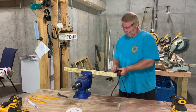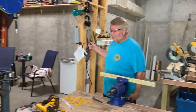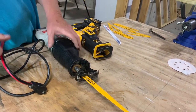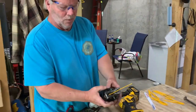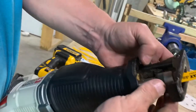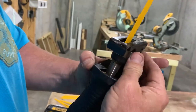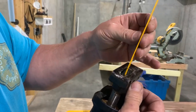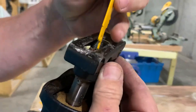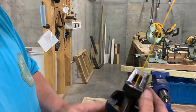Next tool we're going to cover is the reciprocating saw. Like I said, in the industry when you're out there, more than likely somebody's going to call it a Sawzall. Before you change the blades, make sure the power is disconnected, whether it's battery or a cord. This particular one has got a real simple blade change. You can see you've got a little gear right here — all you do is push that button, push it that way, and the blade's going to pop right out. Put your blade back in. The blade's got a little spot, and when I push that back, that's what's locking it in. There's a little steel rod that pokes through that hole and holds that blade in place.